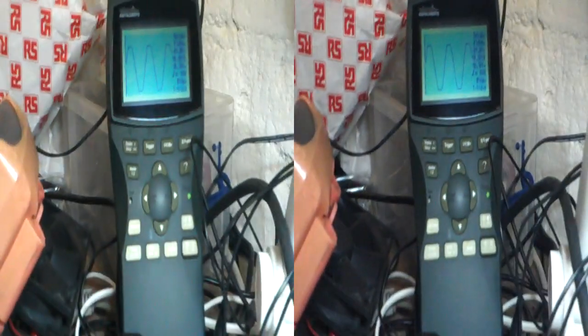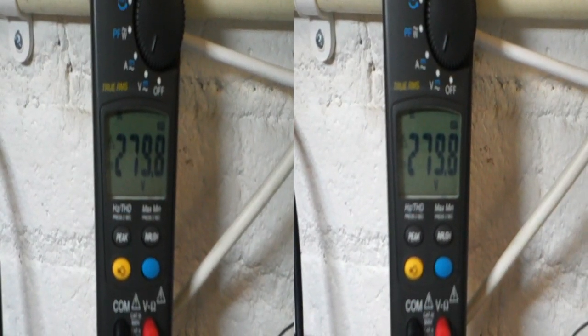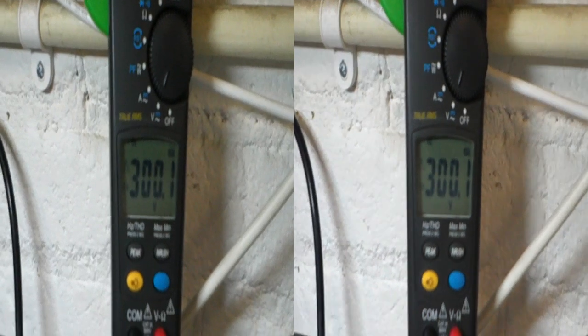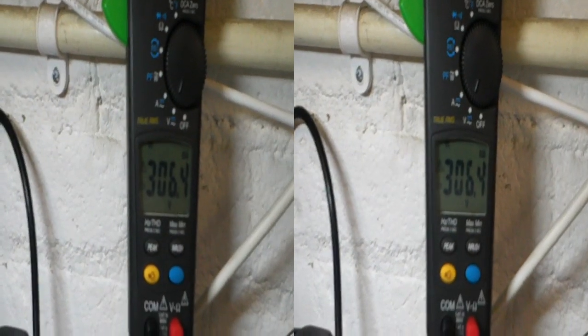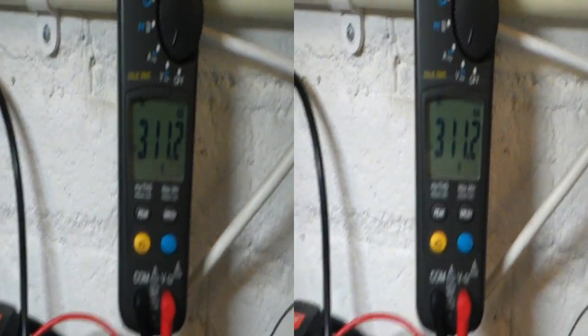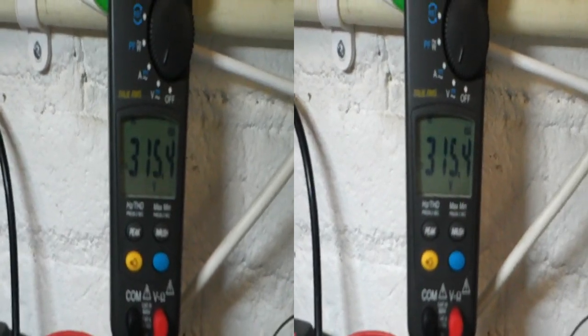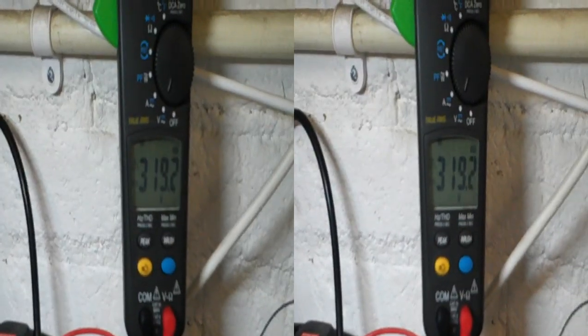So now we can again go to full wave, and immediately we do see it jump. That's 280, and then I can turn it up further, and you'll see it complete the full wave as it gets to the top — it kind of rounds it out, and now we're on 298, 300, and that will continue to go up to about 333 volts. So it's doing a 300 volt charge. You'll see that rise — it takes about a minute basically to go up to the full voltage, which is 333, 334, which is the maximum you're going to get the capacitor up to. This is measured across the terminals of the capacitor, rather than at the triac.